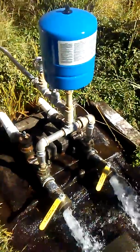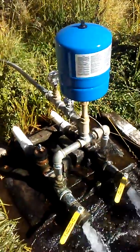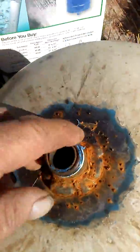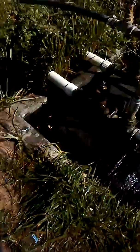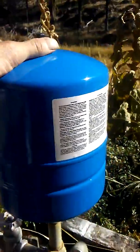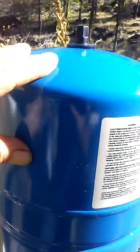Okay, I'm gonna make this fast. This is after 10 years — I just replaced the pressure tank on this thing. You can see where I had to weld it because around here on this old five-gallon tank — when the pump would pulse, this tank would wiggle a little bit, and after 10 years it finally cracked right around here.